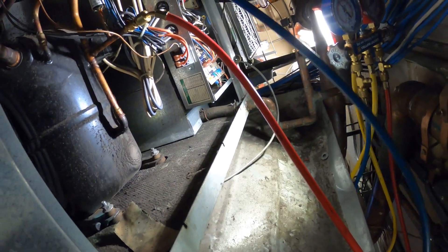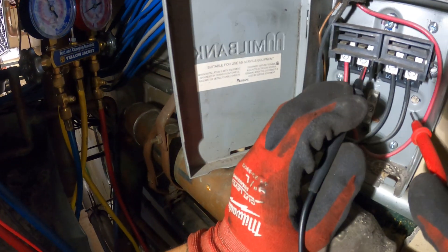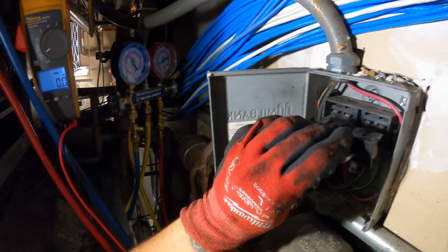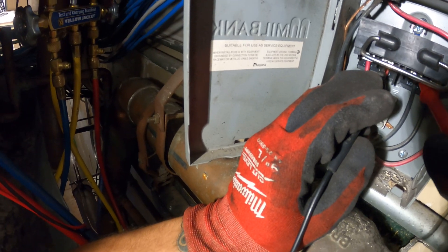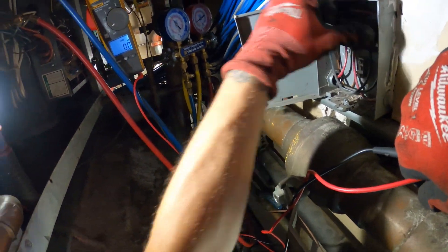What is this thing — hot-wired? Or is it getting power from somewhere else? There's something really strange going on here. Line voltage right here — we got 208 volts. And since I pulled that disconnect out we shouldn't have anything here, but we're reading only one volt. How does that board still have power? Let's put this back in, check our load — we got 208. So this disconnect does turn the unit on and off, but this thing is getting power from somewhere else right now. Even when I pull it out, we still have a light there saying we have power.